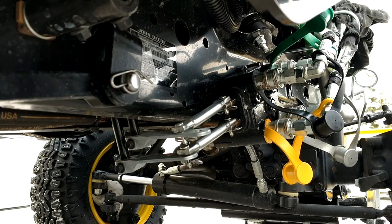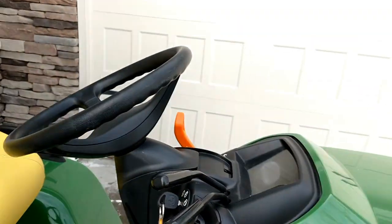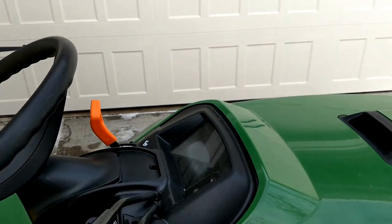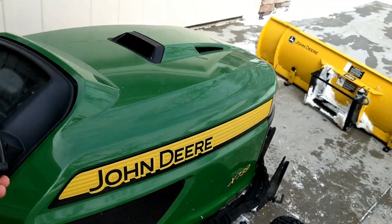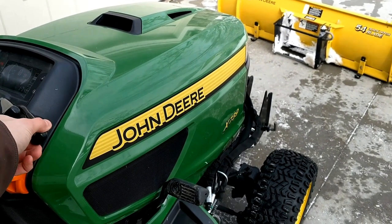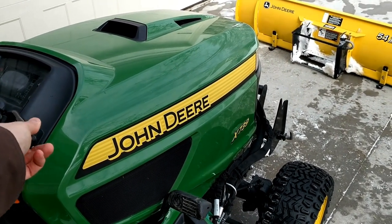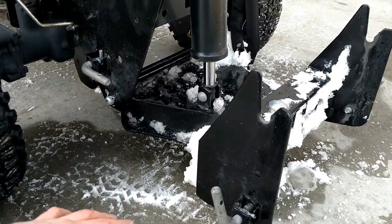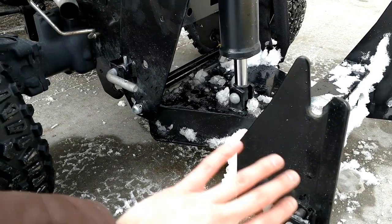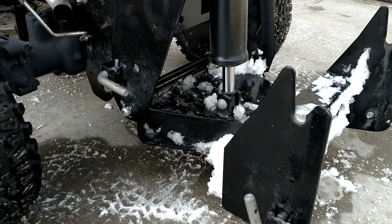So now they're all hooked up. I'm going to show you, just in case you weren't able to get the bottom part of your quick hitch on, how you can go ahead and turn your tractor on and use the hydraulics to lift that quick hitch up. Like I was saying, if maybe when you took the quick hitch off it was lowered as far as it could go and therefore you couldn't swing it back and get these pins in — just turn it on, lift your quick hitch up, and then you'll have room to rock it back and get those pins latched in place.